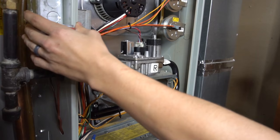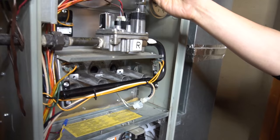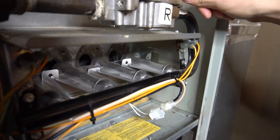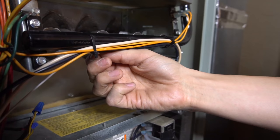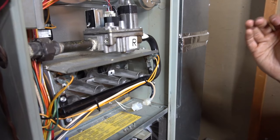Let's try one more scenario. Now we know our sequence of operation, let's say my igniter is bad. I'll simulate this simply by unplugging mine. So the inducer motor comes on, our pressure switch closes, and according to our sequence of operation the igniter should start to glow — or your sparks start to spark. But that's not happening. And you'll hear the gas valve click. So the gas valve opened up for five seconds and then closed back up — that's the duty of the flame sensor. It's a safety: if there's gas but no flame, the flame sensor shuts the gas valve off. So if you hear your gas valve opening up but your igniter never started to glow, then you know that either your igniter is bad, or it's simply not getting power from the control board.